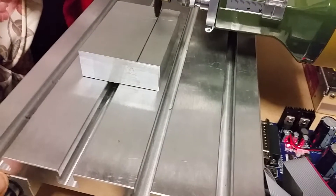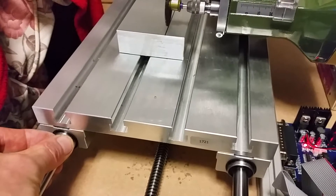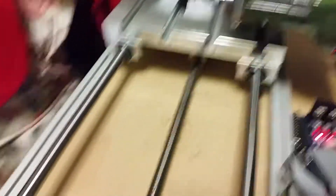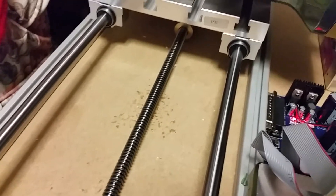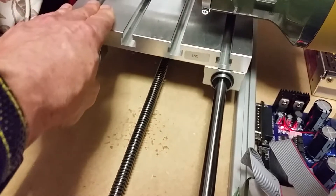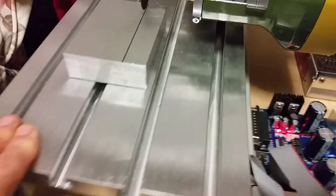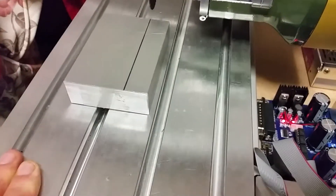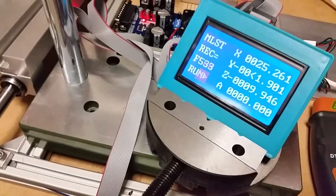That's a lot more smoothly than I can do it manually. When it hits the end there will be a limit switch — so it's reached the limit. At that point the stepper motor would stop and then reverse direction, start going back the other way, pulling the table back and cutting another groove. That will keep going backwards and forwards, run by the program, progressively cutting the metal until it's cut through.